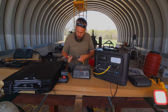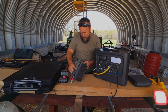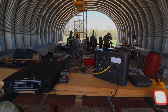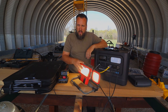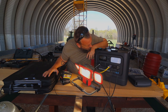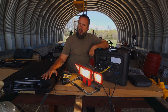I really need to move the Model A and the battery's always dead, so we'll hook up this battery charger: 50-amp engine start, 10-amp boost, 6-to-2-amp charge. We'll run it over and hook it up to the tractor to start charging that battery. At this point we're running the work light, a DeWalt battery, my camera battery, my cell phone, and a trickle charge to the tractor battery — all of that is taking 300 watts, and this will run for 7.6 hours running all of this at once.